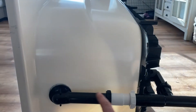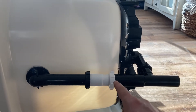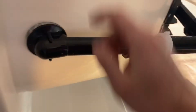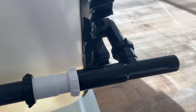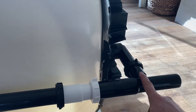Here's everything assembled. I had to make a slight modification because our tub is a little deeper than average, so the pipe would just barely reach the gasket. We ended up adding an extension tube in the middle to give it enough depth to seal properly. This is sealed with a rubber gasket up here and screwed in from the front. There's a stick with a stopper that you can adjust with threads — when you lift the tab it pulls up so water drains, and when you drop it back down it plugs the drain.